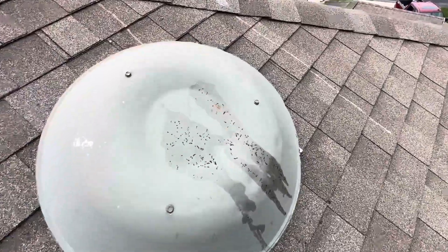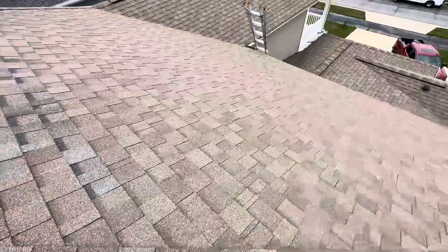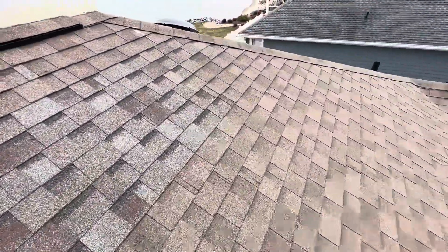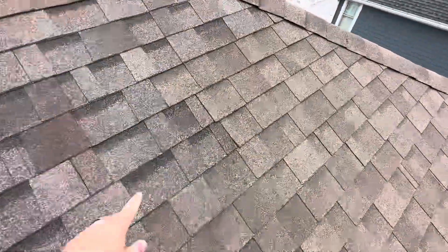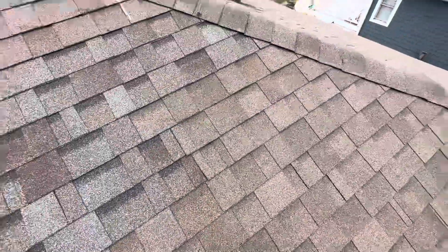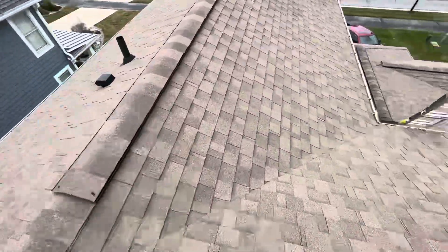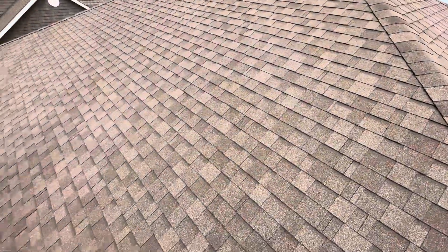There is hail damage on the sheet metal here. I don't see a lot of indicators on the rest of the roof. This is the only thing I've seen so far that I'm concerned about — these two seams right here. It's really not good to have those two butt joints right on top of each other. That could eventually come apart over time. Nothing to get really worried about, but that's something we should probably take care of because it could be an issue down the road.